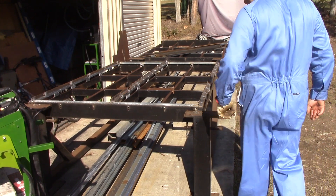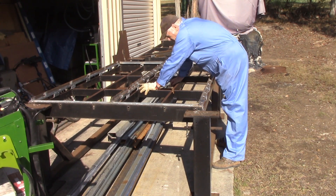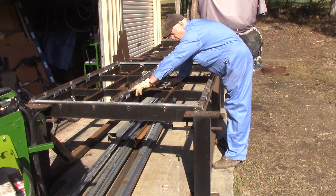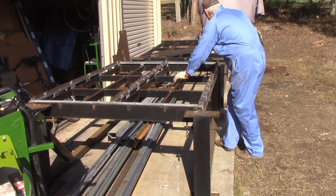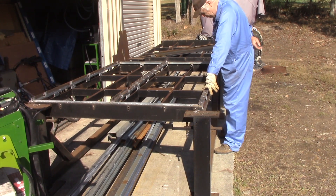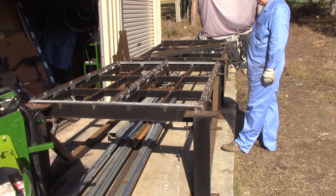Somehow the camera didn't get turned on properly — I've gone ahead and welded all these. I basically put welds anywhere between 10 millimeters and 30 millimeters wide, welding every 200 millimeters roughly — so about every eight inches — except just here where this bend is, where I put it every four inches, because I'm thinking I might get a spanner on that and straighten it a little bit. I put most of the welds down on the flat side, but I did put an odd one on the back, spaced about 500 millimeters — so about 20 inches — apart. That's got them all in place now.